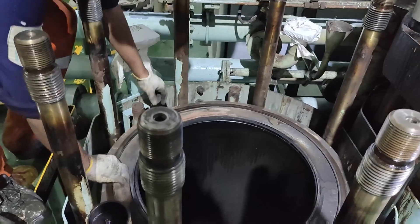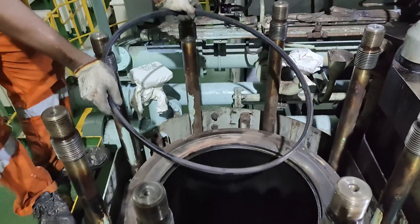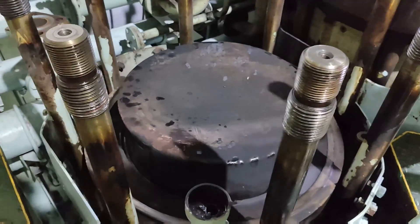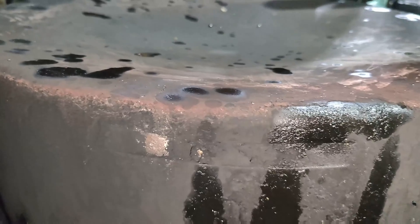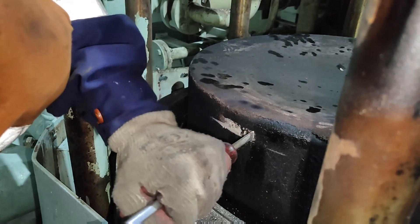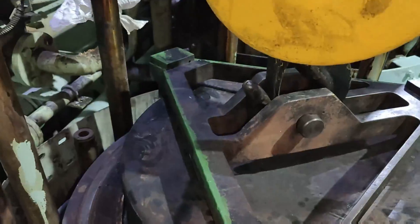Remove and discard the gasket between the cylinder cover and the liner. It is good practice to make a punch mark on the liner and the piston cleaning ring to ensure correct position during remounting. After marking, remove the piston cleaning ring. It is very important to remove any wear ridges at the top of the cylinder liner. Turn the piston to top dead center such that the top of the piston is free of the cylinder liner. The piston is provided with three grooves for the fitting of the claws of the lifting tool — these grooves are always clogged with carbon deposits, so clear all three grooves. Make sure to mount the lifting tool correctly so that the claws enter the lifting grooves of the piston crown.